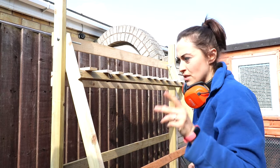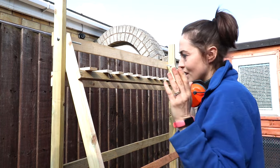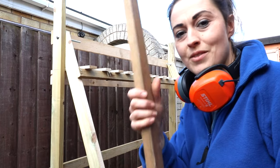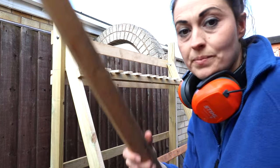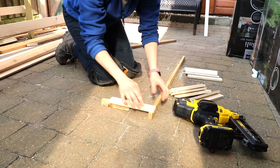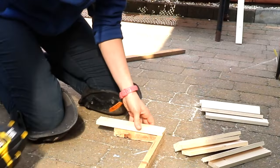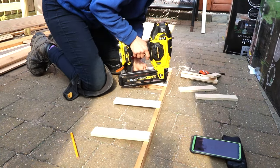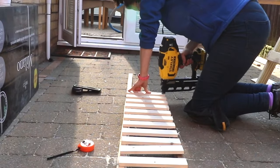It's 110 — let's reduce it by two centimetres, a centimetre either side, so I've got 108. Two battens at 108. Then let's go with 103.5 centimetres because this is the shorter piece and I want to use it up. Then for the fun part — nailing them together. To save me from doing some maths I just nailed the outer ones first, then the middle one, then worked out the centre of each of those pretty much, and the last few I just eyeballed what looked right to speed through it.